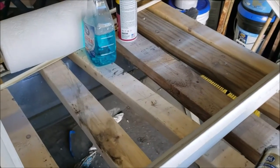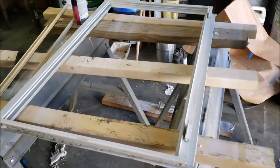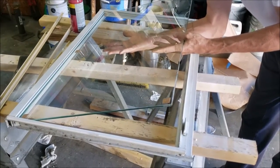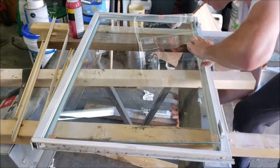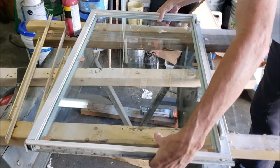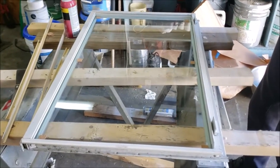Also keep in mind — as you can see I'm not wearing gloves, which I should be. You should wear gloves, a long sleeve shirt, and all that when dealing with plate glass — that was my poor choice. Here we go putting the glass back in with a little caulk already in there, setting it down to the bumpers with a little bit of pressure. Let that dry and we'll put it back in the house.